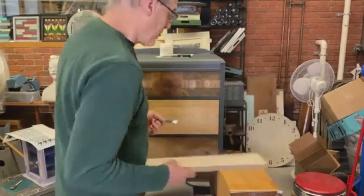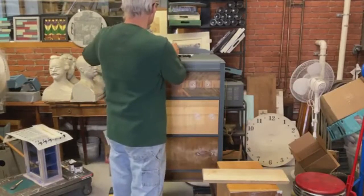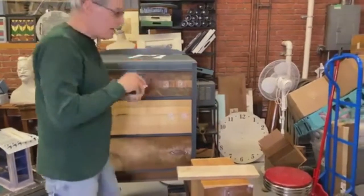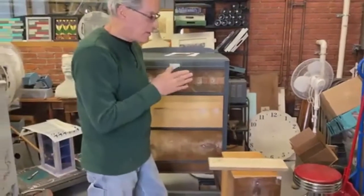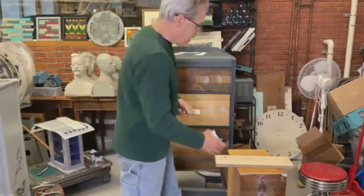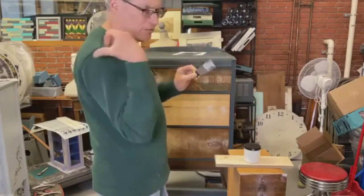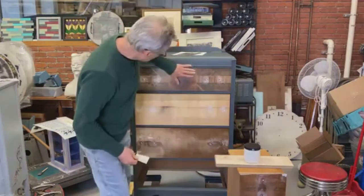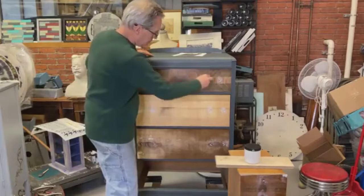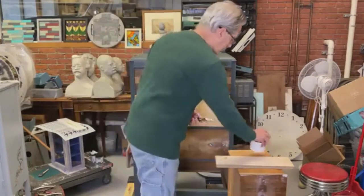When we filled the holes of these drawers, we did either 3 or 4 coats. I actually applied 2 coats just today, and it only takes about an hour to dry. It's really thin, very sparing. Scrape it all back out. That's the key. The reason I like this particular little kit is that they're bigger. If you've got a really big area that's missing a section of veneer, you could go across the whole thing, but you just want to be careful with it.